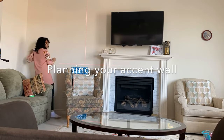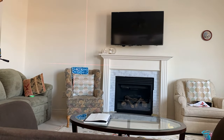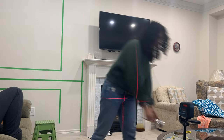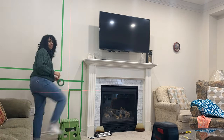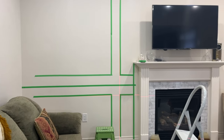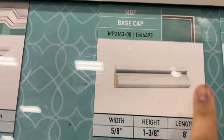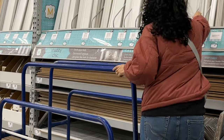I like to start off by measuring all the walls — we need the height and width of every single wall — and I like to draw them in my sketchbook. From there I use painters tape to map out my design. Painters tape is a great way to visualize how big you want the boxes to be. Here's a rule of thumb: chair rails should be about 30 to 36 inches tall depending on the height of your ceiling, and try to build an odd number of boxes on any wall — either one, three, or five boxes. When you go to your hardware store you're going to see there are so many different types of molding — just pick the one that draws your eye the best.